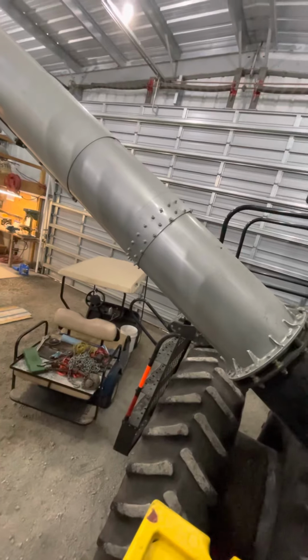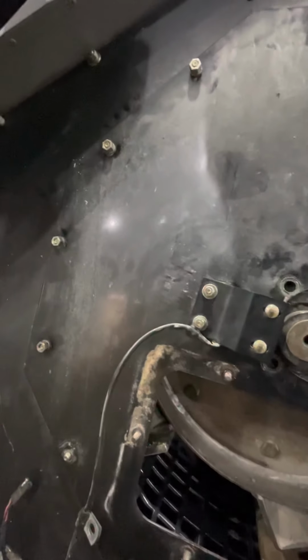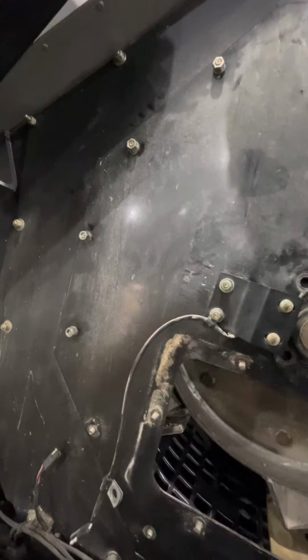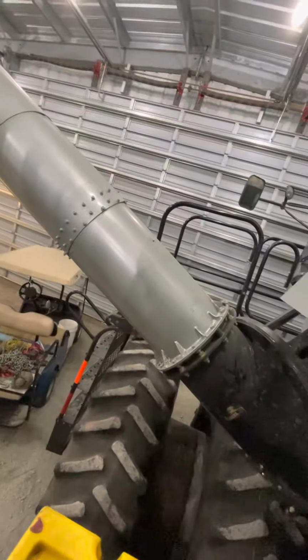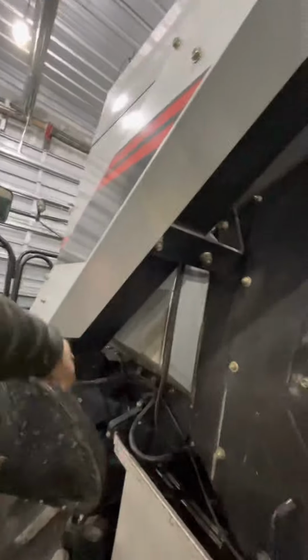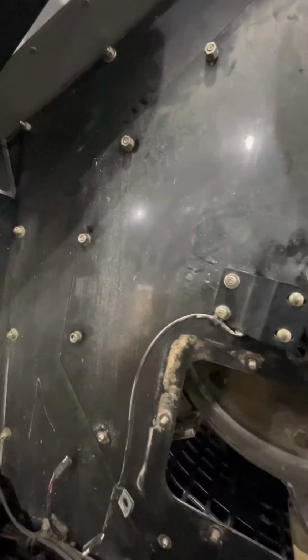But like I say, pulling the rotor out of a Gleaner combine is a lot easier than a John Deere, Case, or New Holland. I think I've said before I've helped my neighbor on his 8120 Case combine. It's a big machine. You gotta drop the throat of the machine clear off, and then the rotor drum goes out underneath the cab, below the cab and above the front axle. And so that's the nice thing with the Gleaner, it's pretty simple.